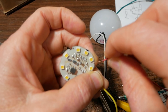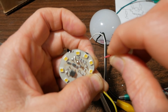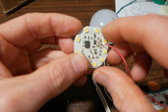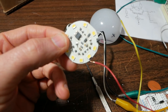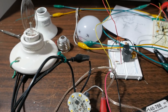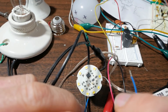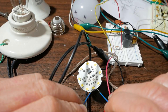I've gone around and checked all the LEDs using a 9-volt battery with a 4.7K resistor, went around to each one. This LED here does not light. So if I hook this up to power and bypass this, the other LEDs should light up. I'll hook this up to full mains voltage — I do have a bulb limiter to limit current just in case. Taking care that we are on full mains voltage, I'm going to jumper that dead LED and see if this lights up.